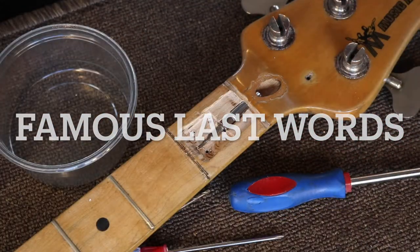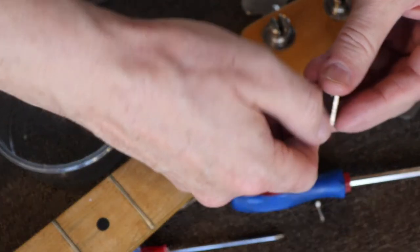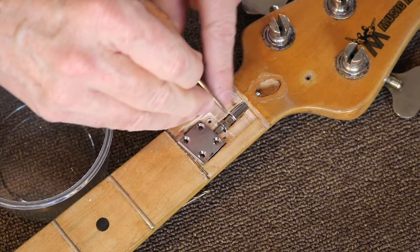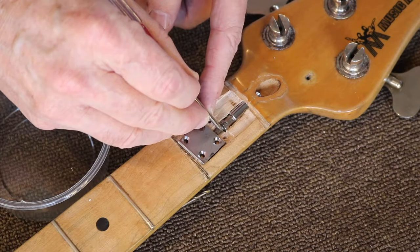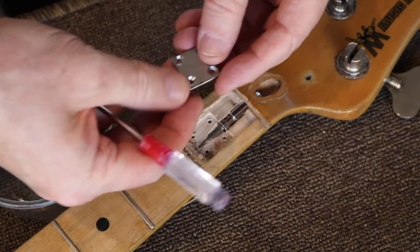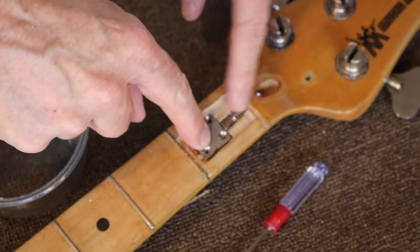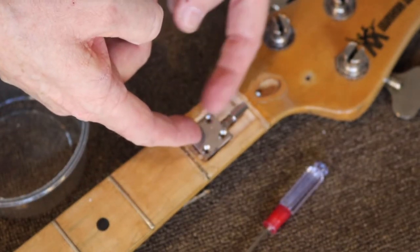Now, I'm not going to swing on these screws. It's not like I need to swing on them to get it to go really tight down. I just need it to hold. But I'm going belt and braces, because what happens is that this steel nut moves. When you press it, this nut will press up against the wood. And I think you can see a little gap in the wood there. That nut moves the whole way up to the wood before it gets a real purchase against the wood. So the top being cracked, it didn't get as much purchase. So this is supposed to go on and stay down, and the nut presses against that and it holds down. Now, when I did the test, this started to come up, which would be no good.